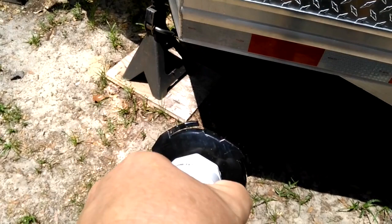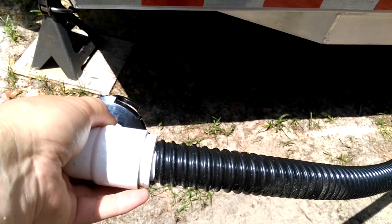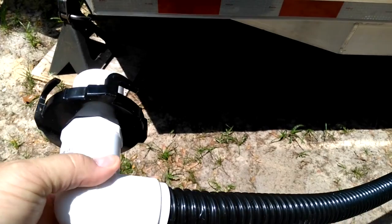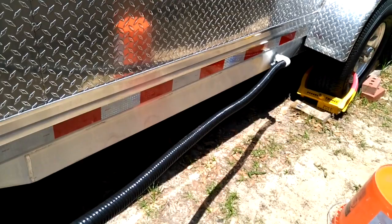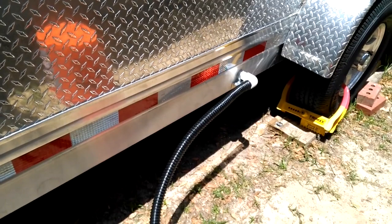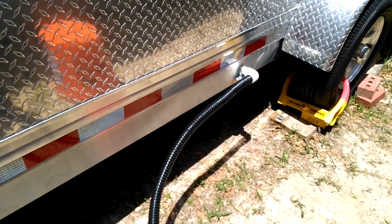I could also connect this to an outlet at a park or somewhere they have water and sewer hookup, but it's just a one-inch pipe — it doesn't need to be any bigger than that because you're not going to run that much water through it. It's not like a home unit or a black tank with toilet paper coming through. That's about it — that's how simple I made it. I try to design everything simply. I know we have all these traditional ways of doing things, but a lot of it is just a waste of time and money. I hope this helps.